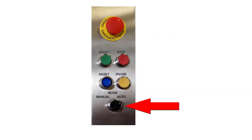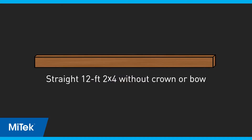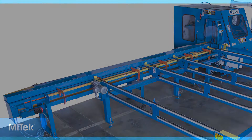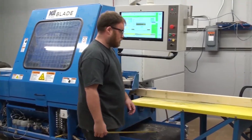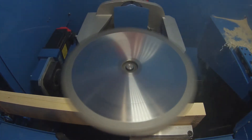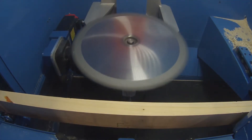Place the saw in auto mode and start the saw blade motor. Use a straight 2x4 as instructed in the supplies list without any crown or bow. It is not necessary to use the cut straight board feature, but it should be a high-quality straight board. Clear the saw of lumber and place the board on the in-feed rail. When done, the board ejects automatically. For the angle axis, the saw blade is oriented parallel to the top edge of the board and will make seven plunge cuts at various angles on the top edge.